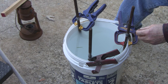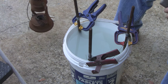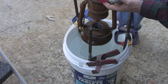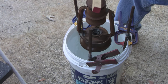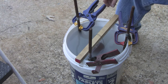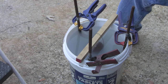I wrapped the wire around both — it's just thin wire they use to tie rebar together. They say if you use copper it gets all funky, so we'll try this. I got my lantern ready to put in. I wrapped the wire around the handle so I know I'm grounded to the lantern itself and not just the top half. Just make sure it's not touching any of the bars. It's not touching the bottom and it's fully submerged.